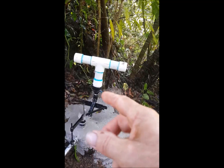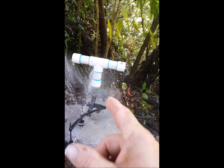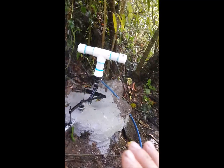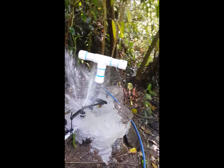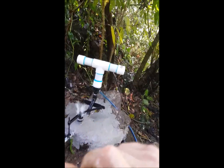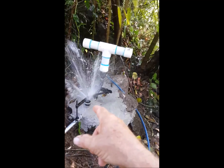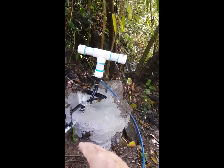It has Teflon tape and joint compound there. And to have access to that, there's a rubber check valve in there, only rubber. There are no metal-to-metal contacts anywhere in this pump. Everything is just flexing rubber or rubber to metal. It has a bronze seat for the inside valve there. You never have problems with that. Those valves basically never give problems. Those down here depend on how hard they pump. One has lasted 5 years.